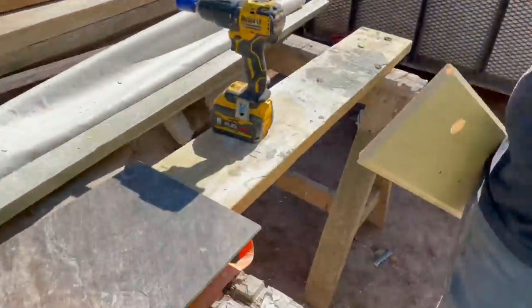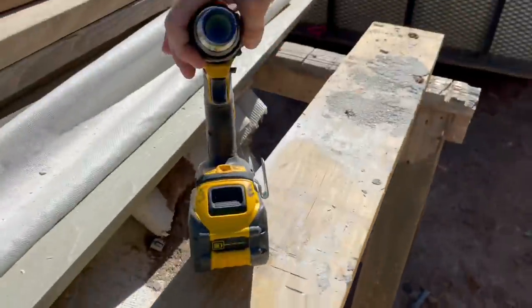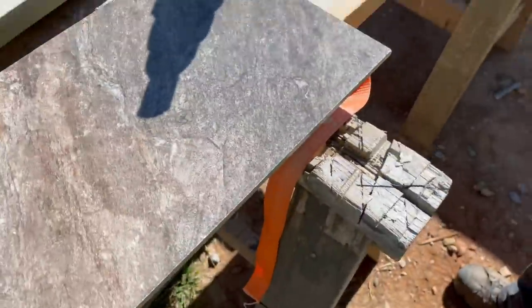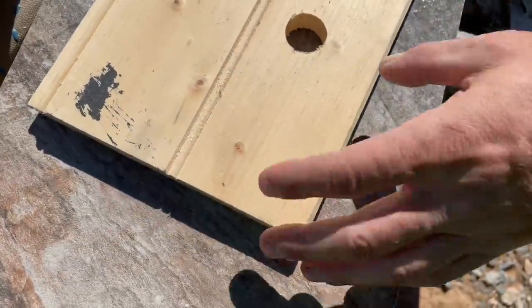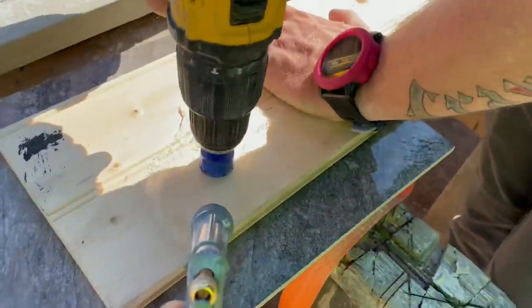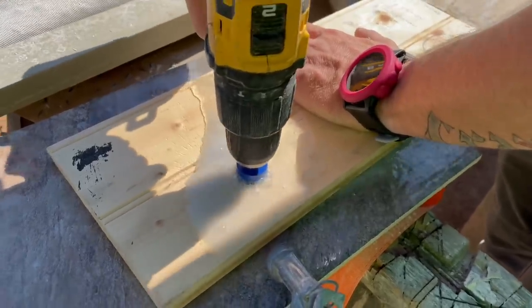John and I need to cut a hole in the tile for the water supply line. We have a bit that cuts holes in tile, but there's no center bit to keep you centered on the tile, so it's just going to jump around. Pro tip: take a scrap piece of wood, cut a one-inch hole in it, hold that over the center mark, put your bit in there, and that keeps your bit from wandering. Water helps keep down the dust and keep the bit cool.